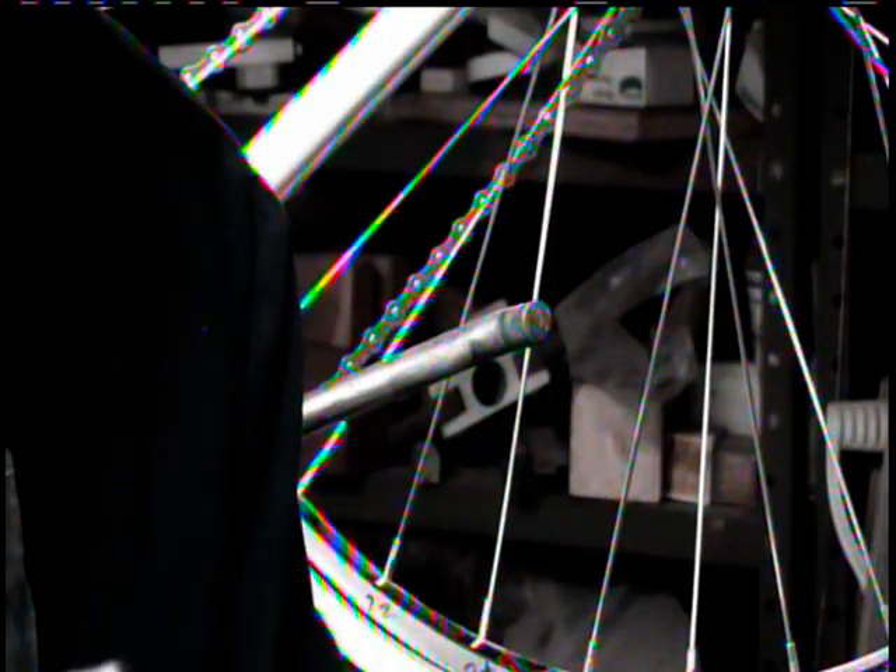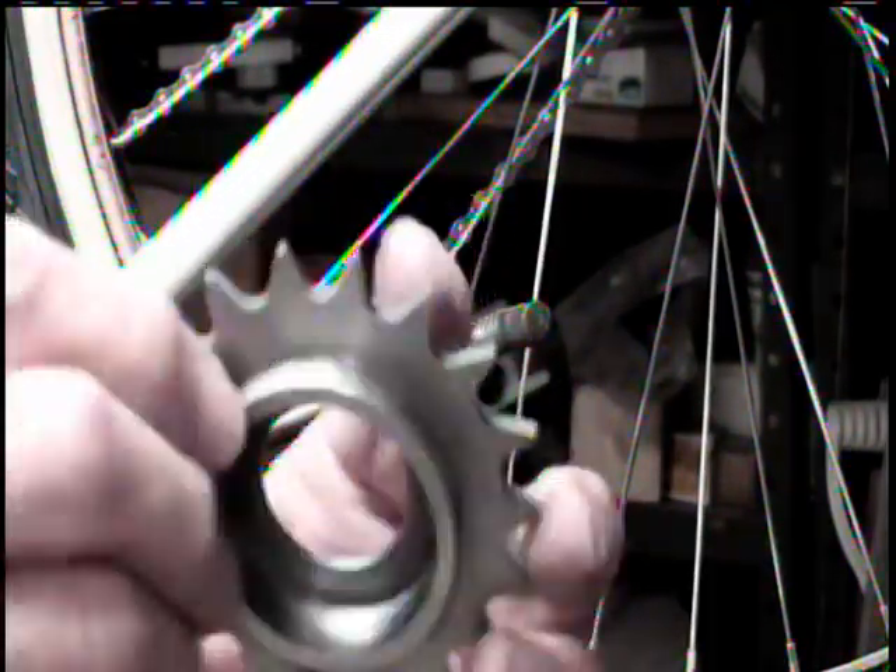This took a little doing — making this piece and brazing it on, on both sides. This is an axle that isn't finished; it's too short and I had to redo it. You have to put the square ends on there, then drill and tap a hole for the crank. The crank fits on there and you just bolt it in — works pretty nicely. I use that on both front and back. This is a pedal crank from a unicycle that I had to cut down. For the one-way bearing you also needed a sprocket, so I had to make this sprocket — it's copied from another one but the hub design for the one-way bearing is totally different, nothing like it is available.